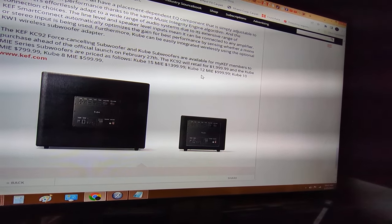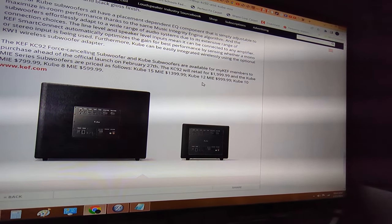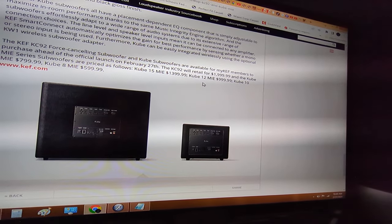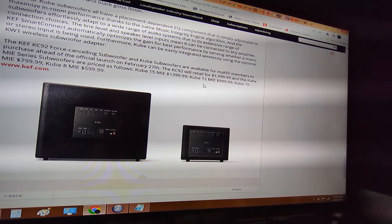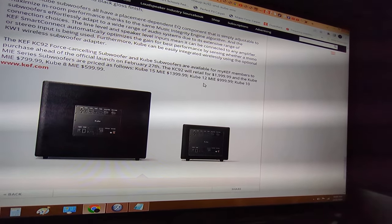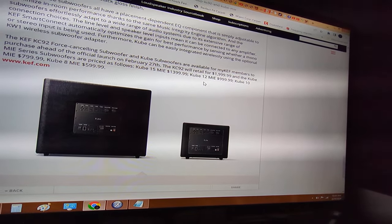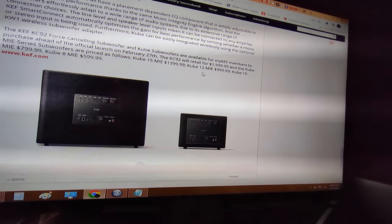As far as KEF goes, I think their most innovative technology was having a concentrically mounted tweeter in the middle of the midrange that shared the same flux as the mid — which is what Larry Frederick did with the tweeters in Cicada. If you look at those coaxials, the tweeter is mounted on the back and they use one big neo motor, which is great because you're using that giant neo motor to power a tweeter — so much flux and really high response. He gets away with it using a reverse mount, like PA drivers, where the diaphragm fires through the center.